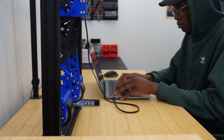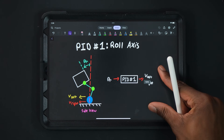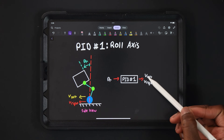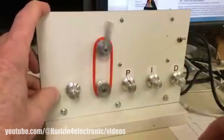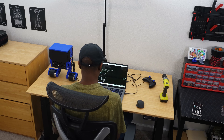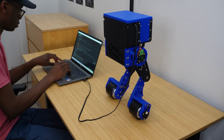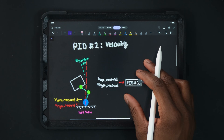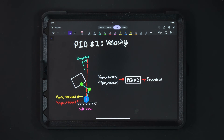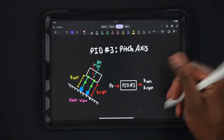As an example, in my control systems class this semester I had to program a line following robot. The cool thing about controls is that we can get the real biped to balance in the exact same way that robot follows a line. Our real biped is unstable, meaning it just wants to fall. To get it to balance, we'll use a PID algorithm — proportional, integral, and derivative. This algorithm will take in the roll angle of the robot read by the IMU and use it to determine the best hub motor velocities to keep the robot upright. You have to tune the gains of the PID controller — think of the gains as knobs that determine how responsive the controller is. Just having a PID controller for roll angle seems like all we'd need, but because the robot's weight isn't perfectly distributed along its center line, it has a forward bias. So we need another PID controller that takes in the measured wheel speeds and outputs the roll angle the robot should balance at.